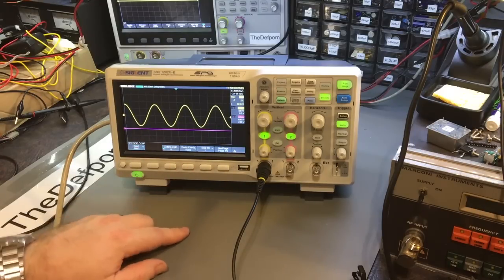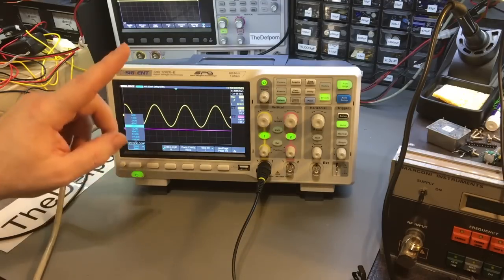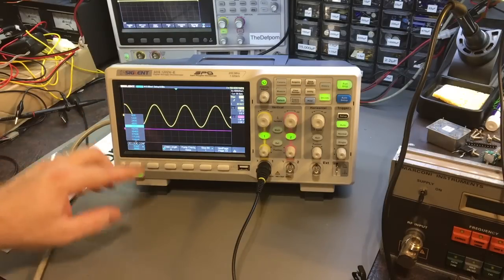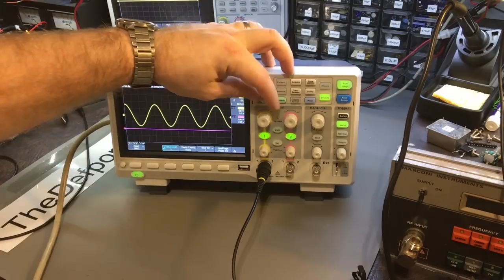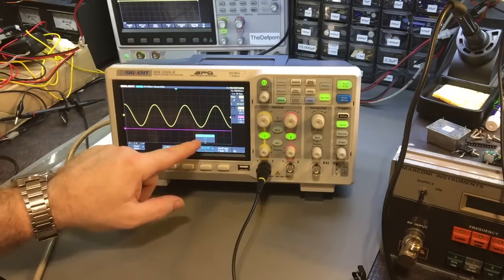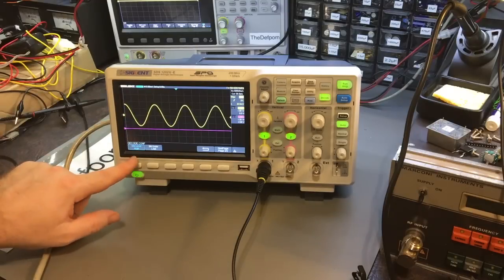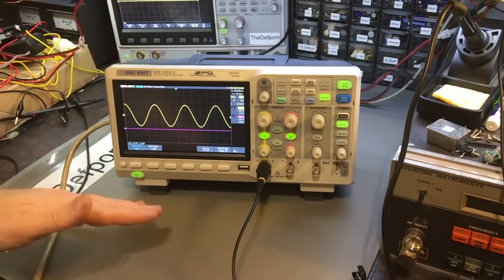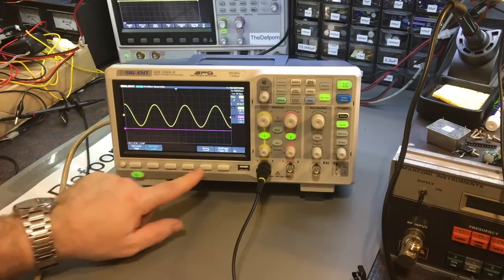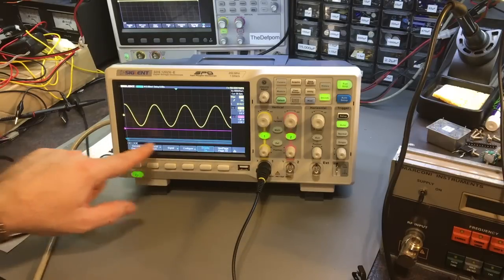Configuration, obviously, then you can check. You can set the baud rates, 600 up to 115200, standard baud rates. You can also set a custom baud rate. You set data lengths, so 5 to 8, parity none, odd, even, stop bits, typical, and high to low level, so where its normal idle level is. Sometimes idle level is high, sometimes idle level is low. Usually it's high. And bit order often is LSB rather than MSB. And you can also turn the display on and off for the decoding here.